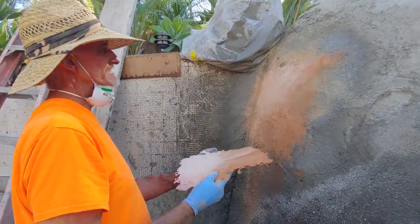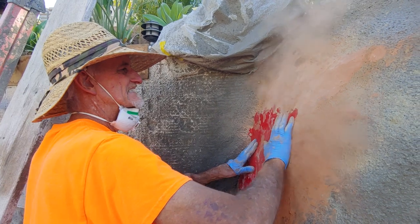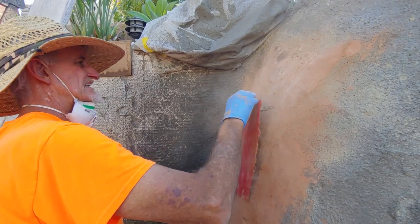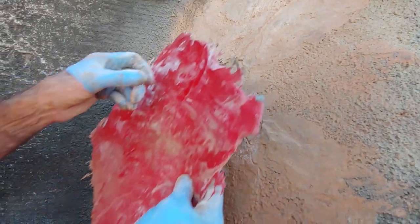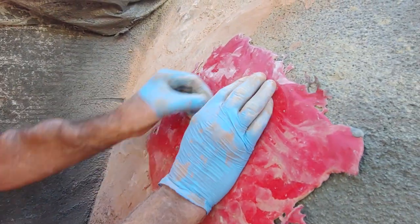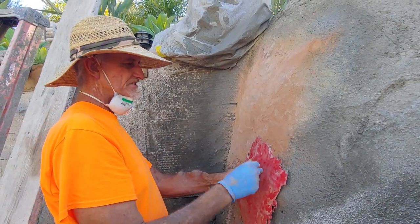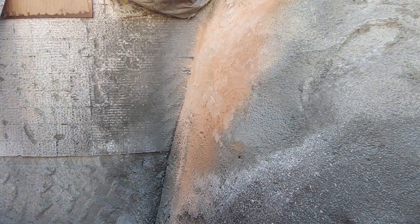Having irregularity to the rocks is totally fine. You want to probably wear your mask with all this stuff going on. That worked out pretty darn cool. I'm going to push in a little bit on the seams — yeah, there we go. So there you get the idea. You can just keep working it; you can spray a new batch of material over it and then re-stamp. There's no hard and fast rule that says you have to do it in one shot. You're the boss of the applesauce — you're making rocks, you're playing god here, and you want a good result. We've got some really interesting textures from that.